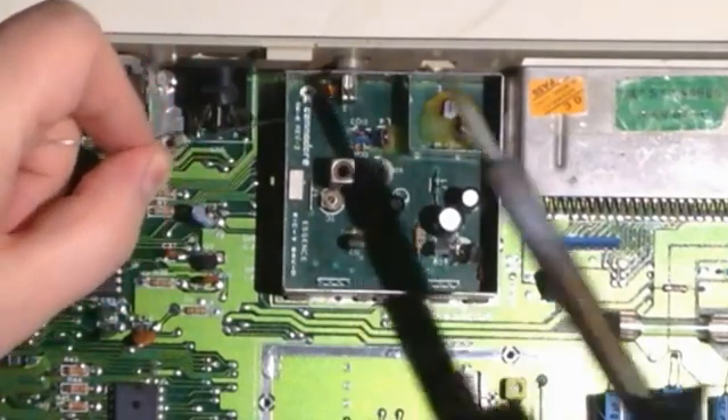The color input is the color of the pixels as an analog value coming from the VIC chip and the graphics chip. The luminosity is like how bright it is — black and white or grayscale signal. What's coming out passes through a transistor here and it's amplified. Down here it's the luminosity input, also coming out here. The color signal goes through this transistor and out, but also it goes down here and it's fed through a capacitor. Capacitors let high frequency signals pass — this is a high frequency signal — and it's mixed in here with luminosity, and therefore you get the composite signal.